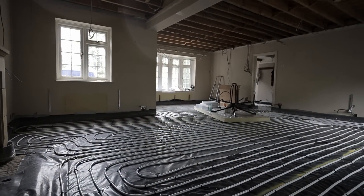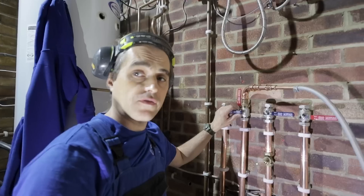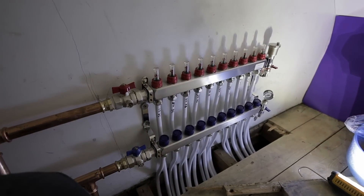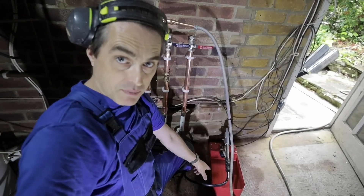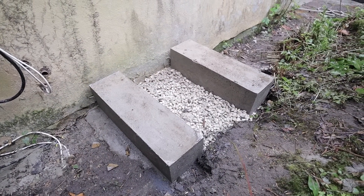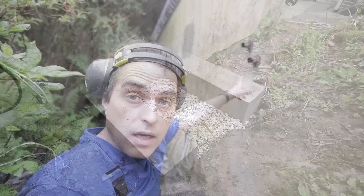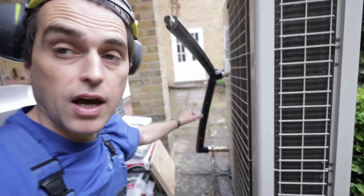The clients were so cold last winter that we need to make sure they've got the most efficient, warmest house possible. 100mm spacing is the way to go if you want the lowest flow temperature, highest heat output, and highest possible efficiency — but you have to resize the radiators upstairs to the same flow temperatures. I'm using just a garden hose to purge water from all the underfloor heating loops with the manifold and all loops open. Once the system is full of water I'll connect my pressure testing pump and pressure test to six bar. Outside, I'm ready to put the unit back — I've raised the base by about 250 millimeters to help with airflow, with pipework insulated in the wall and anti-freeze valve and two new flexible hoses attached.